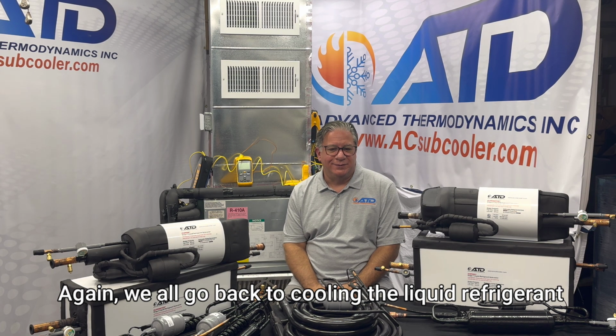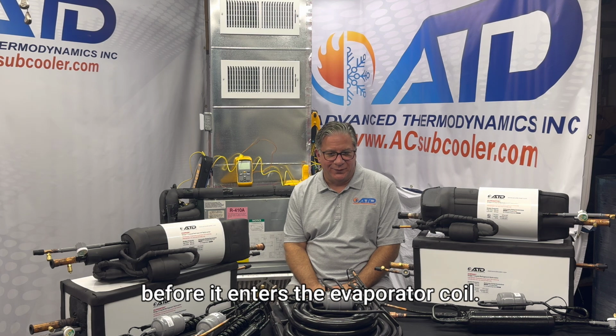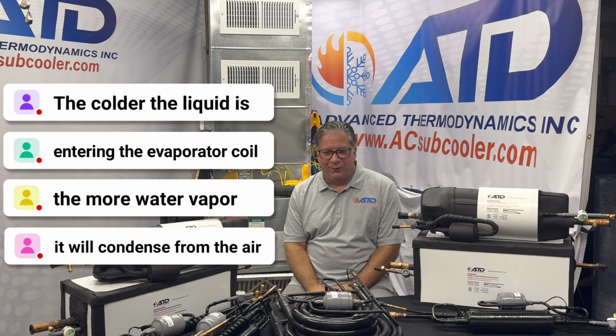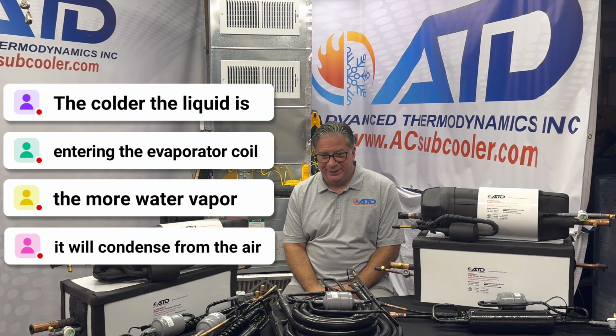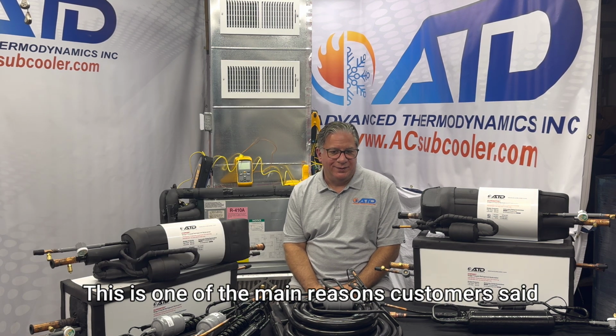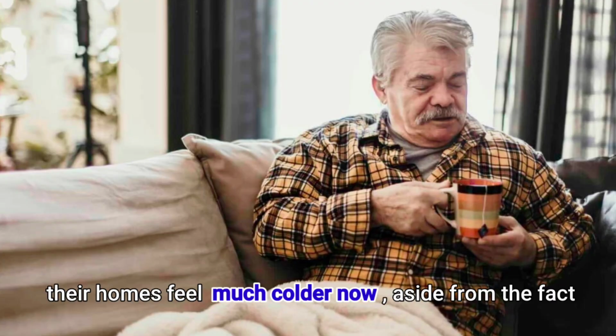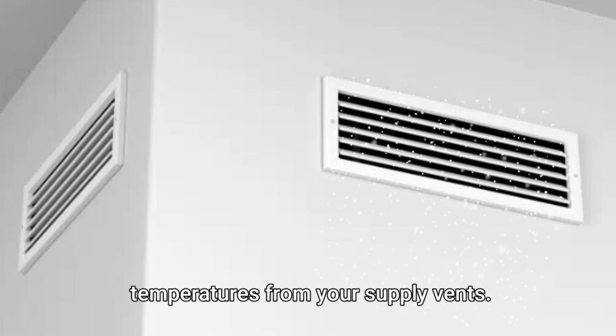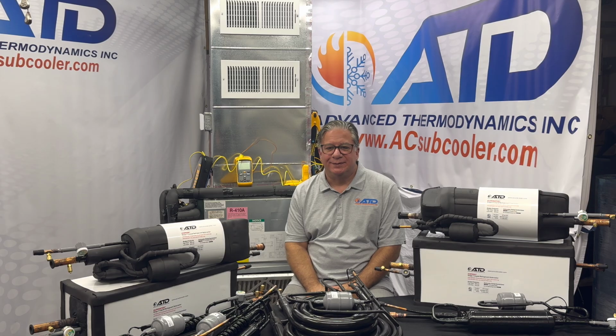Again, we all go back to cooling the liquid refrigerant before it enters the evaporator coil. The colder the liquid is entering the evaporator coil, the more water vapor it will condense from the air. This is one of the main reasons customers said their homes feel much colder now, aside from the fact we now have colder discharge air temperatures from your supply vents.